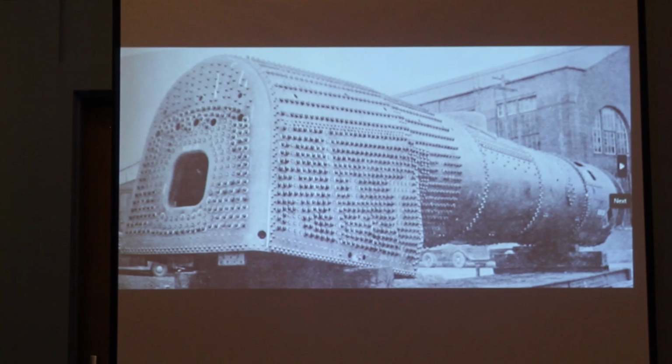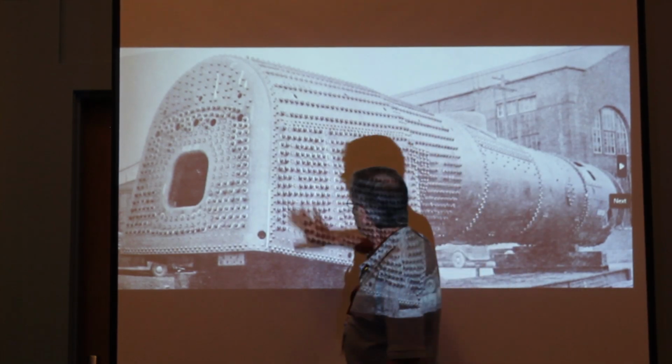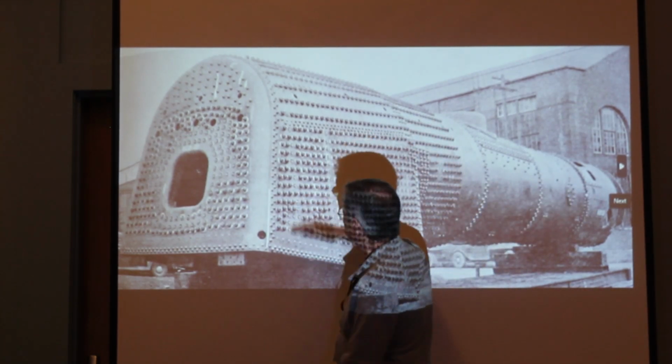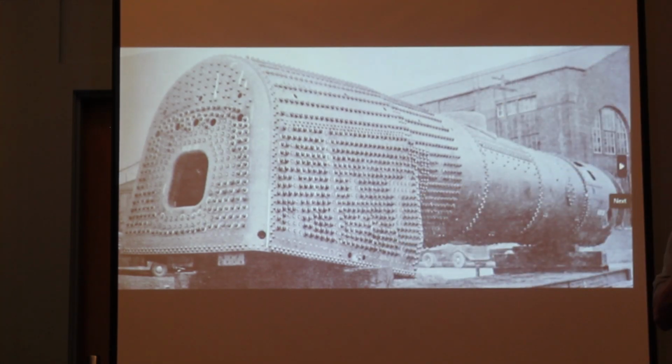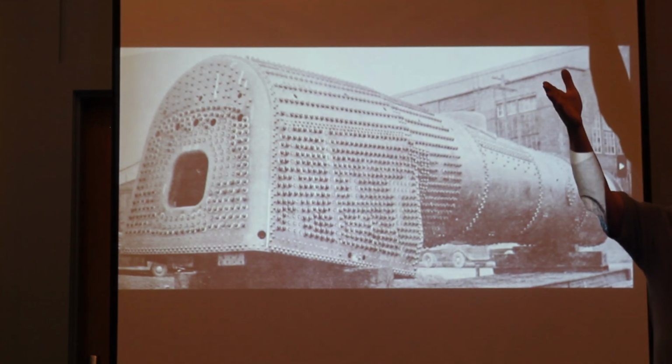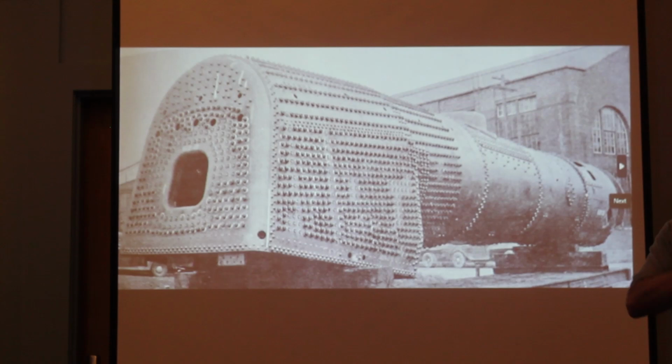All right, a firebox is actually inside, again, the outside of a boiler is called the shell. And inside the shell is the firebox assembly. Typically at the mud ring, it's about a 4-inch wide water space. As you go up, the firebox starts going inward while the shell keeps going up this way. So the higher up you go, the wider the water space is.